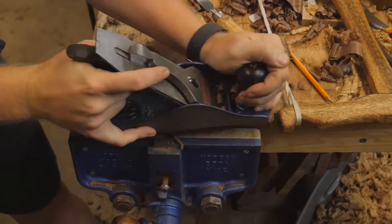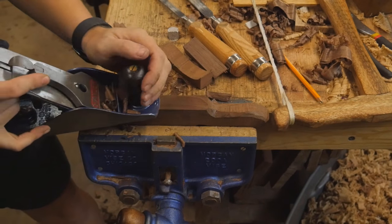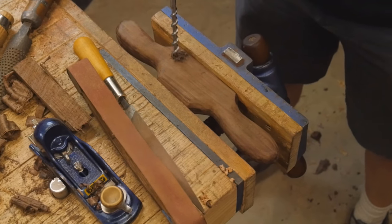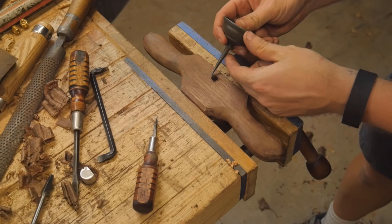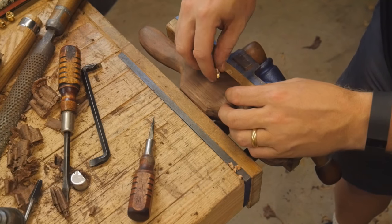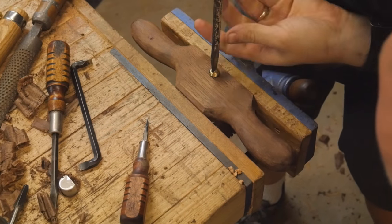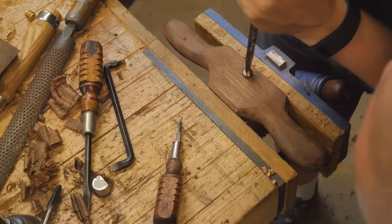Here's another problem. I needed to secure this to the sole and I decided to put about a five degree angle on it. But I should have put about a ten degree angle on it — I think that's the only design issue with it. Next up, I had to drill holes for the threaded inserts, and that was another problem in that the markings for the holes were measured off of the wrong points because I was going a little too fast. A little bit of oil on these threaded inserts allows them to go in a lot smoother. These can twist and become a problem — you need to use a decent amount of force to work them down in. But with a bit of patience, they go in. Unfortunately, I didn't have patience yesterday when doing this.